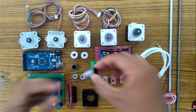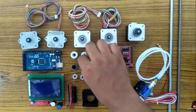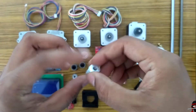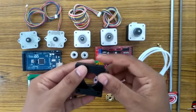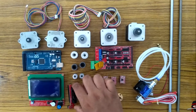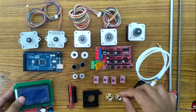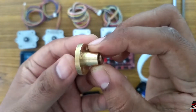These are 5mm by 8mm coupling shafts, and I'll be using two of them. These are the LM8UU bearings and I'll be using 12 of them. This is a 16-tooth pulley of 5mm diameter, but I'd suggest using a 20-tooth pulley. This is the MK8 extruder which will be connected to the stepper motor. This is the LCD by which we are going to control our 3D printer. This is a threaded nut of M8 size and 1.25mm pitch.